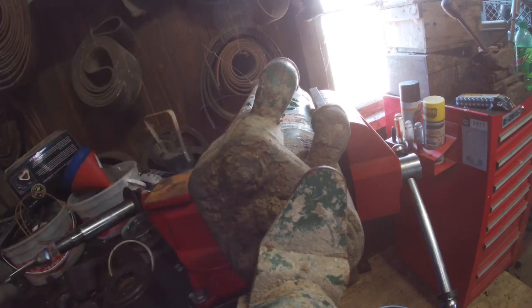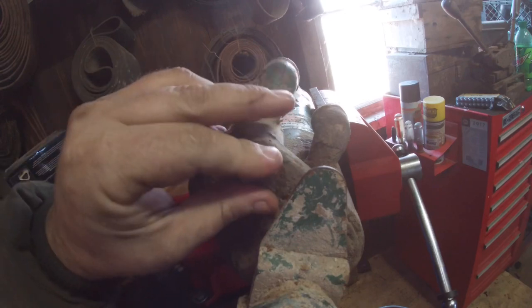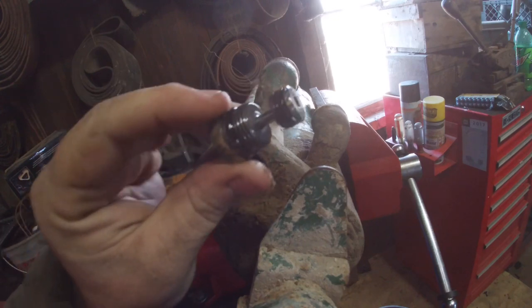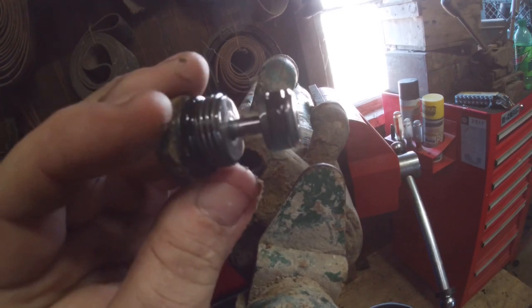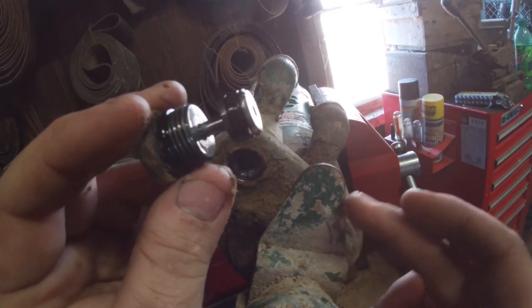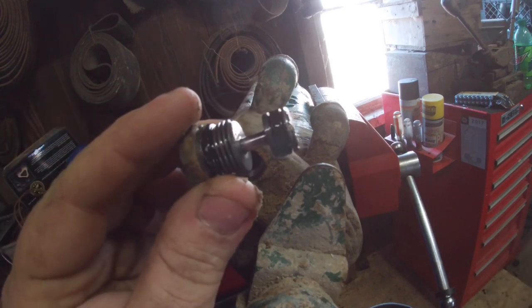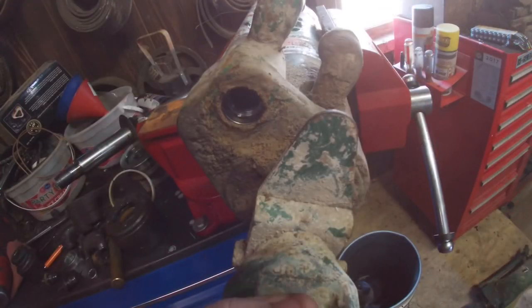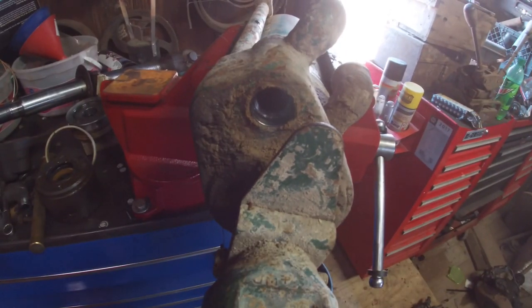There's not much to this — this is just a plunger connected to a little piston with a seal on it and that's all it is. It shuts off the flow of oil so that wherever you manually set your collar, whenever it pushes this plunger, that shuts her down and flips your lever back to neutral and you get the same depth every time. We need to pull this out a little bit just so we can get to the bolts that hold the next piece on and get that out of our way.